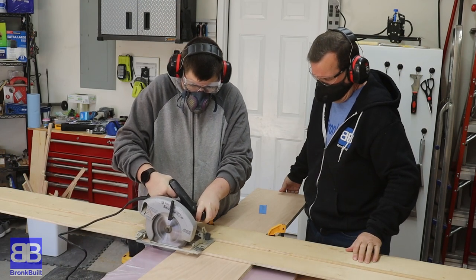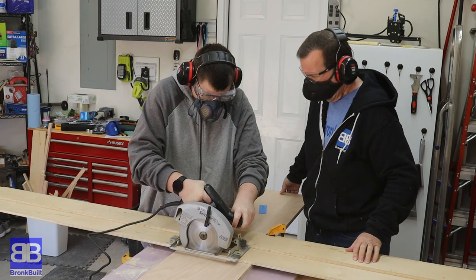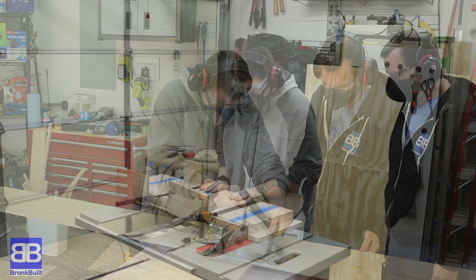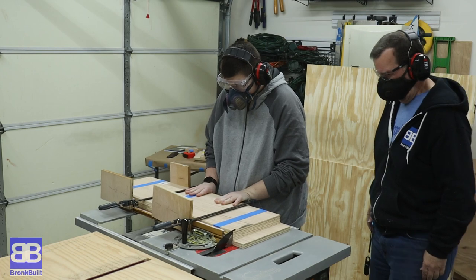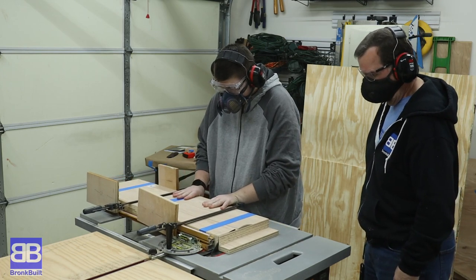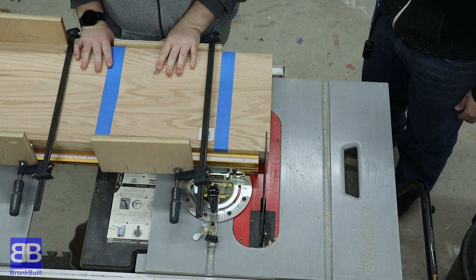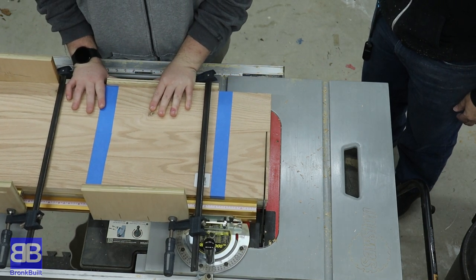This was another tool I was a bit nervous about, but my circular saw actually has a pretty quick brake on it and these cross cuts were pretty short. He cut all the shelves to rough length. Once we had all three shelves rough cut to length, we used double-sided tape to tape them all together and flush, then wrapped them with blue painter's tape just to be sure they would not move. We clamped the entire thing to our miter gauge and cut both sides. The reason we taped them together is so we can cut them all at once so they're the exact same no matter how we cut it.